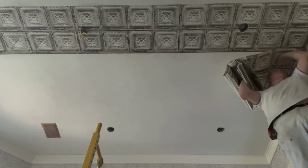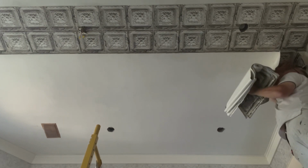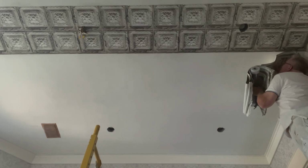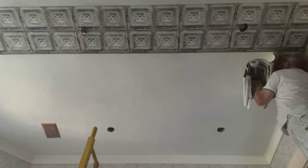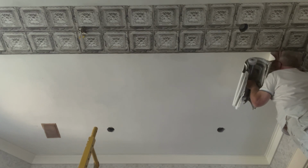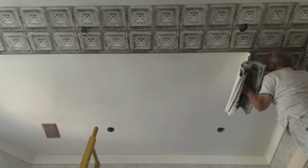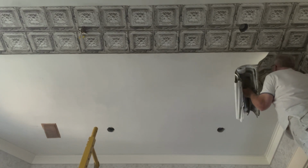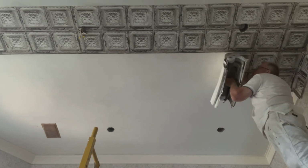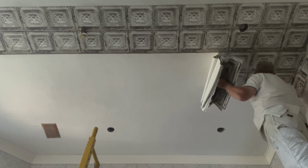Second consideration is, look at the way I have flapped the wallpaper in my right hand there. You see how it's layered to give me the wallpaper as I stand on that scaffold? That is the most important thing to learn from this video. And that is, what hand to hold your wallpaper in? What hand do you use to manipulate your wallpaper and put it into place as you're on that scaffold? Those two considerations are by far the most important lessons that I had to learn before I began hanging wallpaper successfully on ceilings.